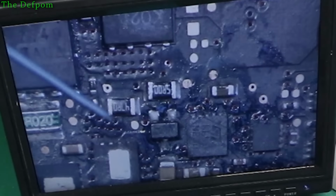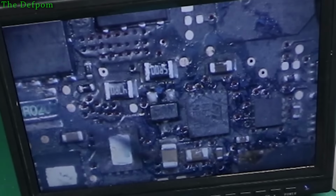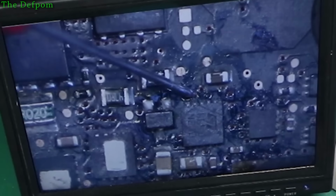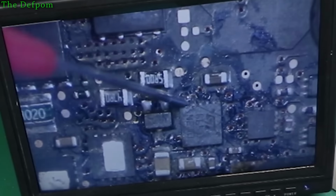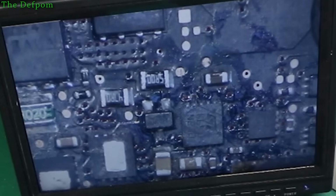So I'm going to have to link from probably that capacitor there, solder onto that capacitor, and onto that pin. Maybe that via. I might be able to scrape that trace up and solder onto that. And I've got continuity through the board on this side, so I hope running a wire from there to there will work. Otherwise, I'm going to have to wire right around the board, which I don't really want to do.